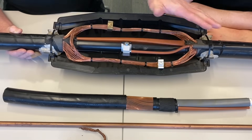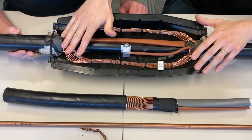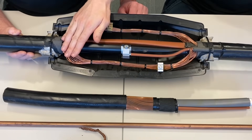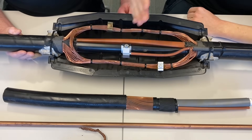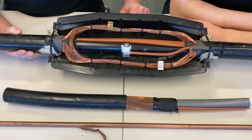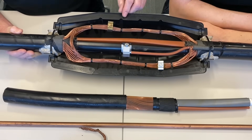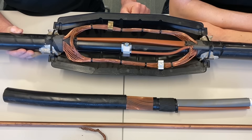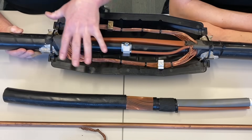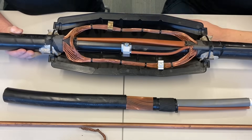The joint is sealed at both ends ready for the resin. This is the modern method of connection, which reduces the need for that staked earth connection. In older systems where cables have been cut, that is where the broken PEN starts to become an issue. Anyone who can find a chamber in their street marked as an earth electrode for their PME system — I'd be surprised. Historic problems mean I don't believe they made enough neutral earth stakes throughout the run, and an aging system has caused problems. Modern cables have solved that problem, but we'll be living with that legacy issue for many years to come.